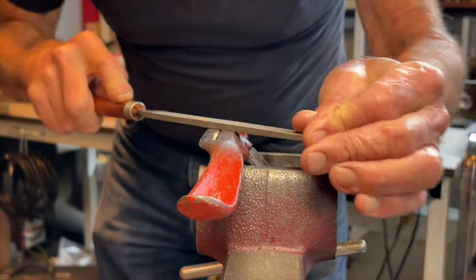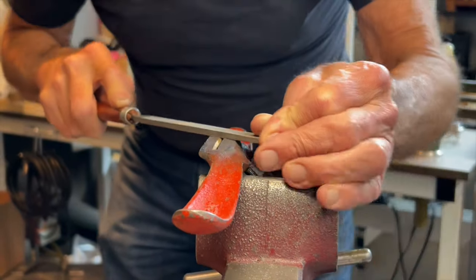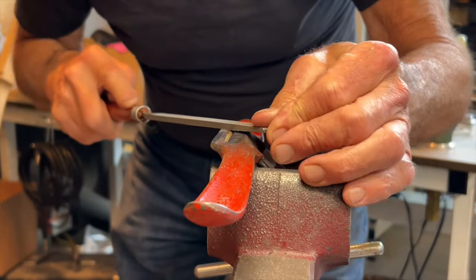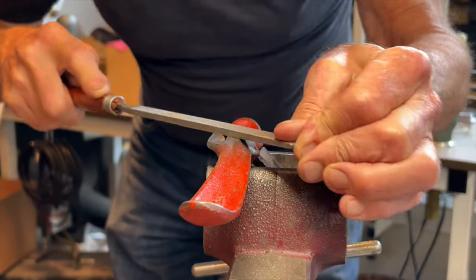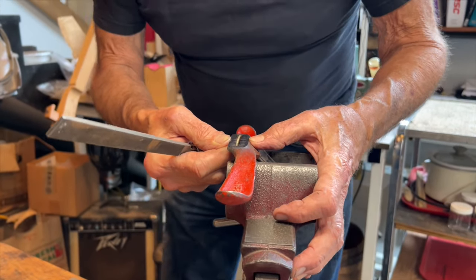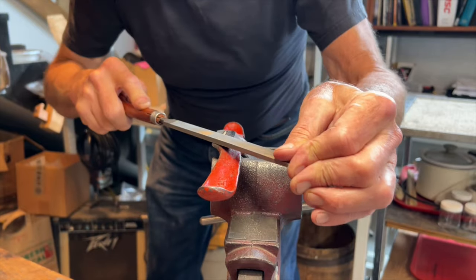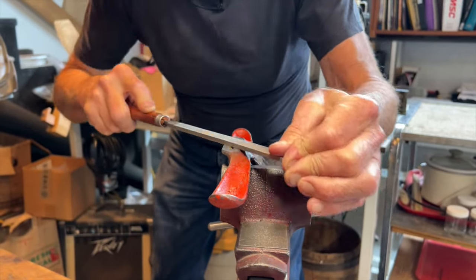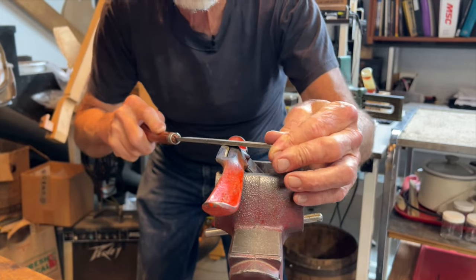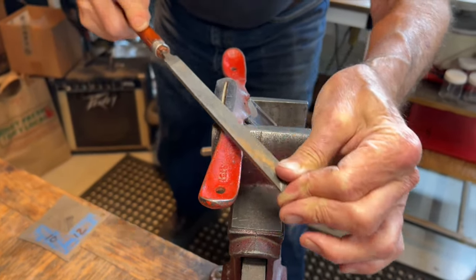These aren't big curves. So we're gonna, can always take off more. We're gonna take off just a little bit. And of course, the length of the cutting bed from here to here, obviously very short. And we're gonna depend on this shape to help keep the tool from chattering or stuttering in the cut. So we don't want it to be too round.